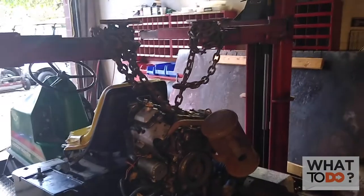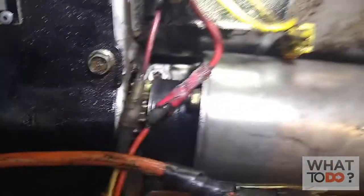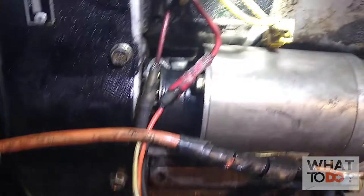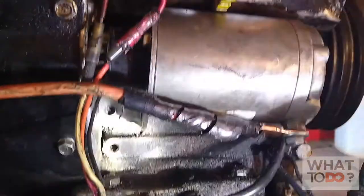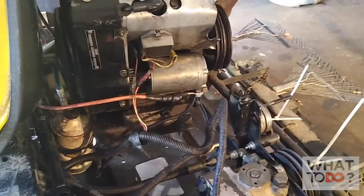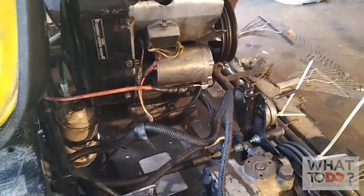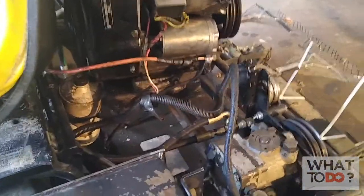As you can see the motor here is up on chains and I pulled it up. There's the top bolt which, with this pump being in the way, the top bolt was kind of all right to get in but I'm still not sure if it's cross threading or not, so I stopped. And now you can see your bottom bolt — I still didn't put that in yet. But when that motor was sitting down in there, I could not get that to go back in. You really need two people — somebody's got to hold that starter straight — and try to get that bottom bolt back in there, and even with a second person we just could not get it to line up.